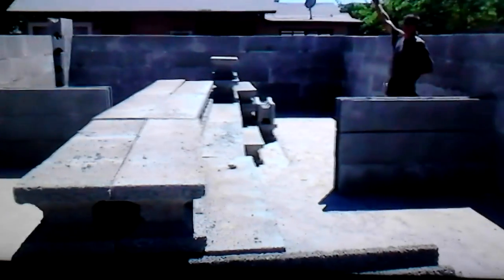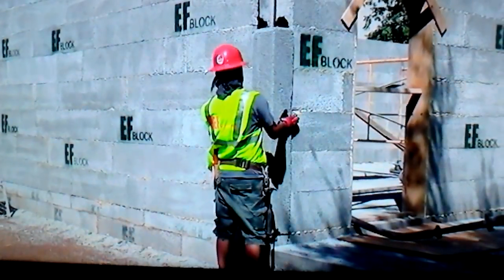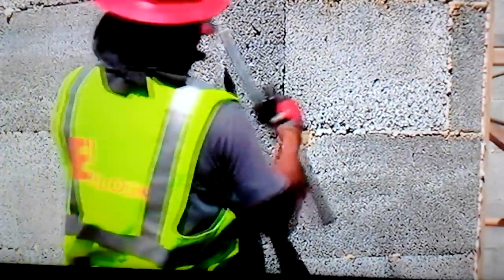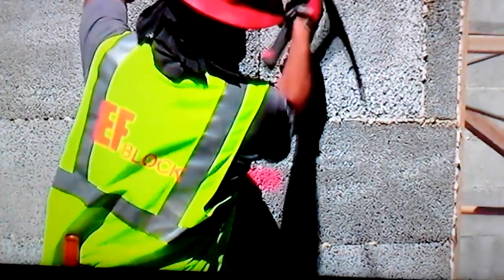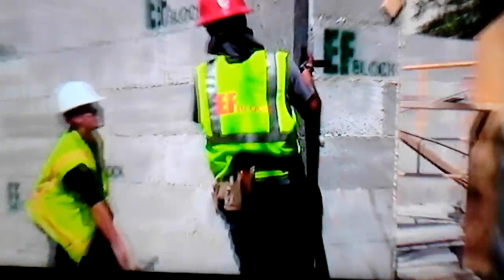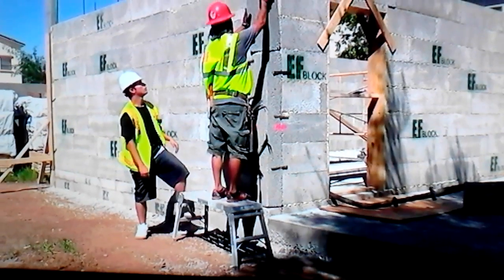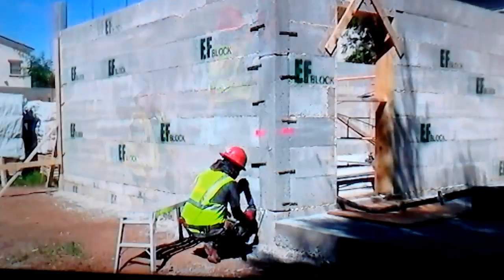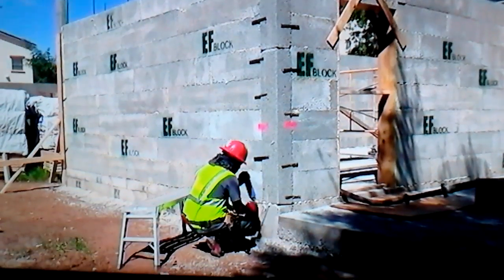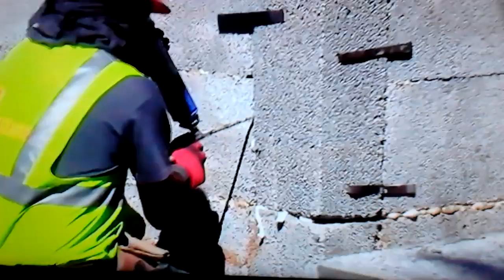You can see the three blocks stacked there to brace it and make sure the wind doesn't blow it over. Now we're up eight feet high. Allen's coming back to put the corner pieces on — these are staples we provide or rent to hold the corners in place; we use them for window and door bucking too, and they come in five-foot lengths. This building was 16 feet on one side and 22 at the other, which is why you see the rebar and corner sticking up higher than the wall. Allen's going to glue the corner piece in.